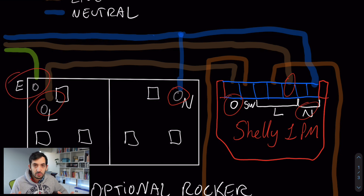So as you can see, with this design we're done. Through the Shelly 1 PM, you can control the socket — turn it on and off. Bear in mind that here in the UK, we also have rocker switches on each socket, so you're going to need to have them always on if you want the Shelly to turn off and on. You can have the Shelly on and these rockers off, but obviously no electricity will flow through.